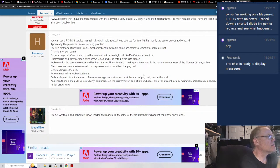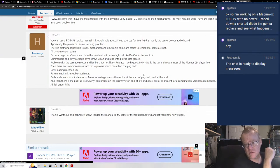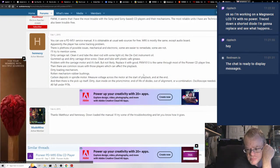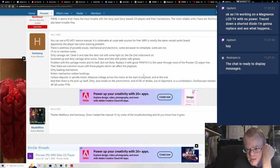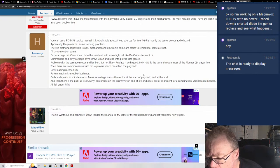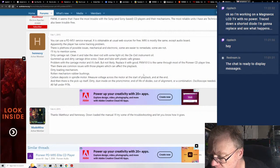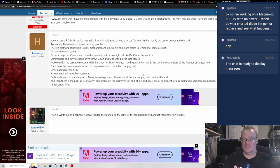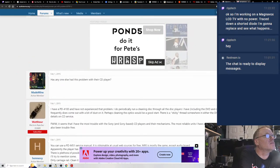Carbon deposits in spindle motor, and then, well, that could explain it, if it's shorted internally in the motor because of the motor being stuck with conductive crap. Huh. Yeah, okay. So, how would I deal with that? Well, let's...